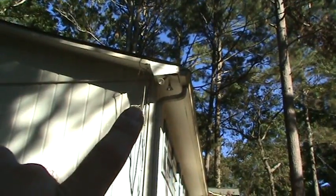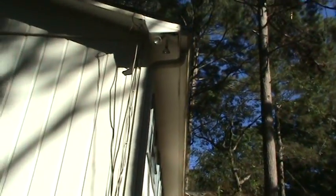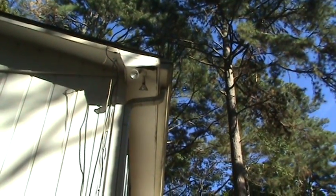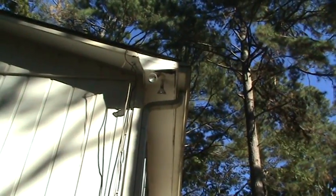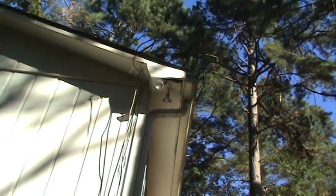She can go ahead — this light is broken anyway. We've got a rotted soffit underneath at this left front corner here, so we'll pull the light fixture, she'll bring us a new one, we can reinstall that and replace this soffit. All the trim wood we use on soffits or fascias is back-primed and sealed all the way around so it won't rot again.